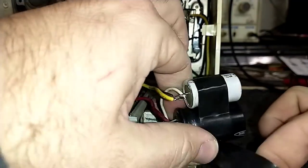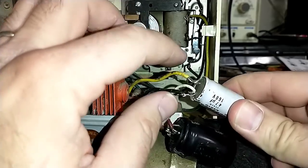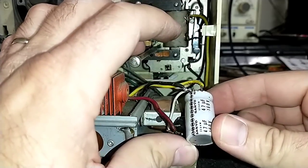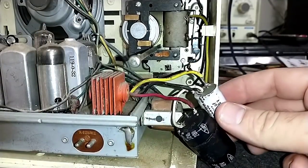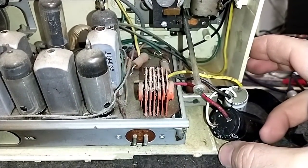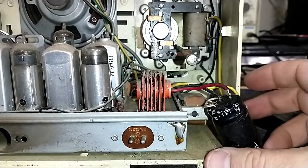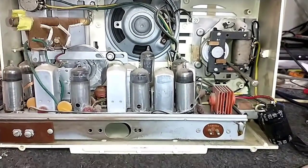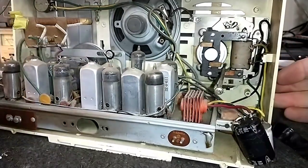This is a 220 microfarad at 200 volt — a little overkill for this radio, but whatever. Let's undo the electrician's tape, the adhesive of which is failing, so this wouldn't have lasted very long. Another great tack solder job in there. This one's bulging too — 47 at 160, Sanyo. Probably knowing GE it had one of those cardboard things in it and they reused these individuals. That capacitor was shorting against the transformer — that would have made for a nice light show. Always check them.